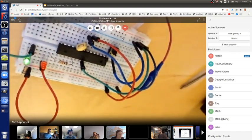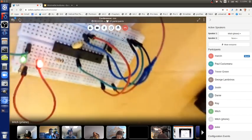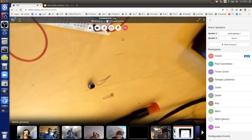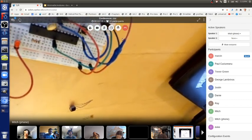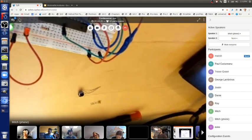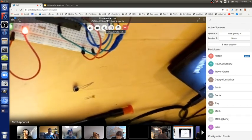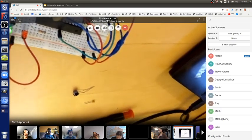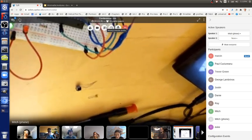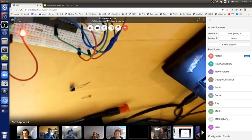Okay, so I don't know if all of you know how to solder. That's something that I teach a lot, but I don't think we have time for that today. My comic book shows how to do it. It'll probably work without it, but it would be nice to just try adding an extra small piece of wire that's about 1 centimeter long, which is like a quarter inch to a half inch long, and then it'll always work if you connect that to ground.